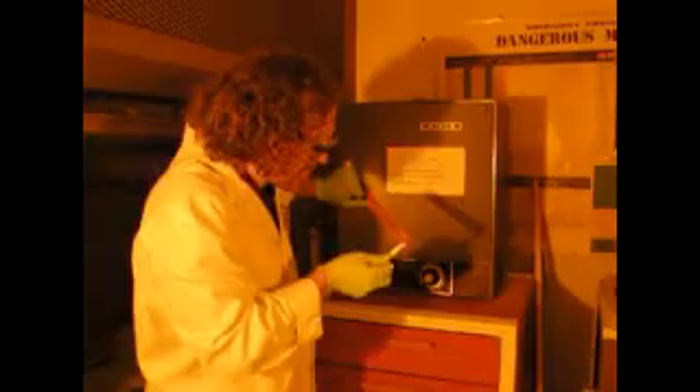Sometimes if there's a little space that develops, you have to do a second coat — but this looks really good. We're going to take it over to our full-spectrum sunlamp. I'm going to place this mask over it that I made with a computer drafting program and printed out on overhead slides. I needed four of them because the slides weren't dark enough. So I'll place that over our sample, set these lead blocks on our glass plate to help keep it down, and turn on our light.